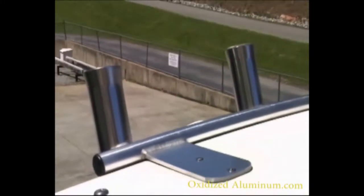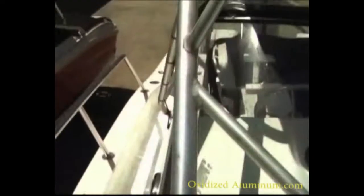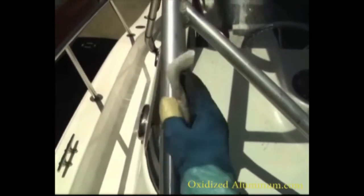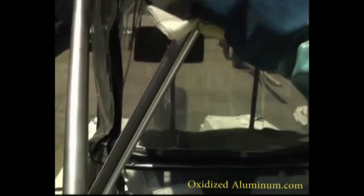Here's an after shot first. We're going to take our cleaner and clean the surfaces. I'm wearing gloves, but the only reason I am is because the owner was using WD-40 to grease up these surfaces — it temporarily made them look good — so I'm removing that with lacquer thinner.